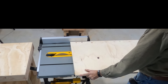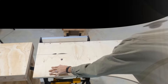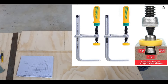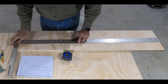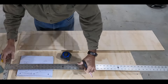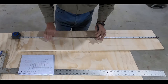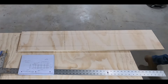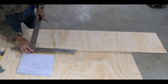The base of this jig is essentially 10 inches wide — in my case I'm going to make it 48 inches long. After the wood is cut, it's a matter of cutting some dovetail grooves, which will allow me to use dovetail clamps from Matchfit. I laid out the grooves two inches off each edge running longitudinally, then cross grooves four inches from either end and every 10 inches after that — five cross grooves total and two longitudinal grooves.